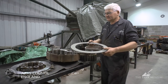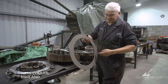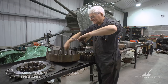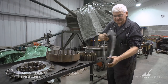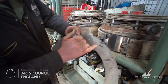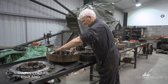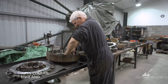So these are modern materials. That one will actually be riveted to that plate there. We've been drilling the rivets out because we have to drill the new plate and then rivet new ones on. So again, this is at the early stages of rebuild. On the inside of this outer of the steering clutch, we have a set of toothed steel friction plates. This is an old one which we referred to quite a while ago when we started the restoration — it was actually broken and cracked. Since then we've had replacement ones manufactured in the same material. That actually slots into the drum like so. It's not quite sliding at the moment because we haven't cleaned the drum out; we need to do a bit of hand fitting.